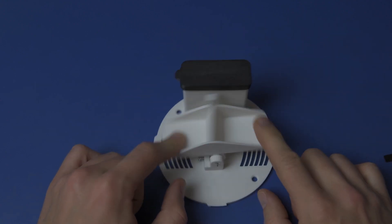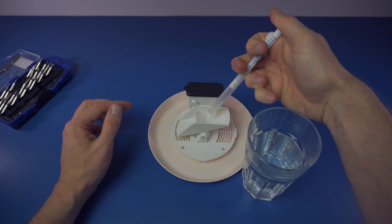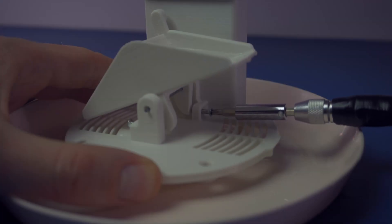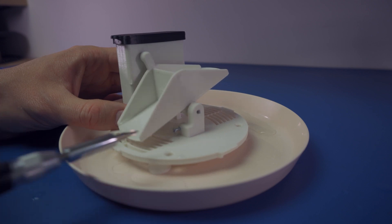To make the result as precise as possible, both buckets must be identical — they need to react to exactly the same amount of water. And even though they are identical in Fusion 360, it may not be the case after printing. This is one of those things I wouldn't have predicted if it weren't for my extensive shower testing. To calibrate the buckets, use these two screws. Pour a measured amount of water — for example 8ml — and slowly turn the screw until the bucket tips. Do the same on the other side. This ensures that both buckets respond to the same weight.